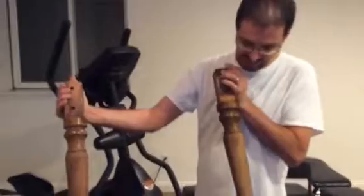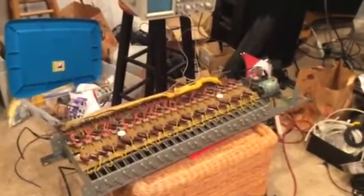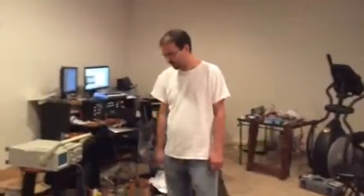Now I have to learn how to play Hammond, and do a lot of circuit board design, and we have the beginnings. This is my first piece of cabinetry. We have a set of Hammond A legs purchased off of eBay, and that's the woodwork part that I was most concerned about recreating. When you are insane with electronics projects, once you've taken the wheel set out of a Hammond, why wouldn't you make it MIDI controllable and put it back? So that's project number, let's say, 5 or 6 in line. Eventually the intent is, yes, to MIDI control the tone wheels.